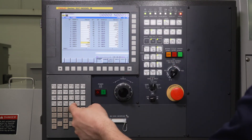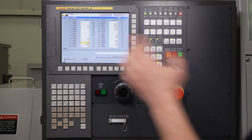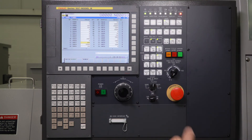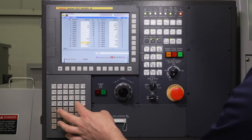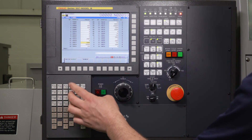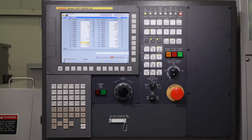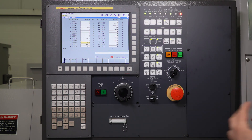In MDI you can change this value. If you change it to 500 — which would be half a second — it's going to default to 496. Not a big deal; that's just the default on the Fanuc control. If you want to make it one second, you can set it to 1,000. First thing I'd do is change it to 500, let it go to 496, and try to run it there. If it's still giving you false alarms, increase it a little bit higher. Anything more than one second and we should probably look into mechanical issues with the machine.